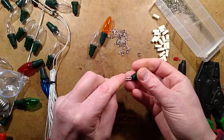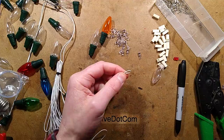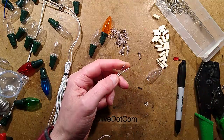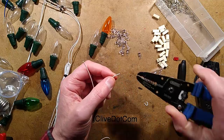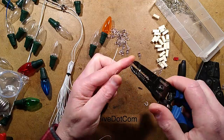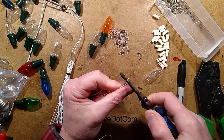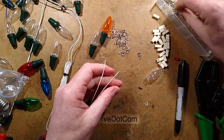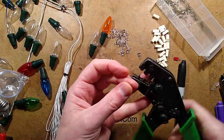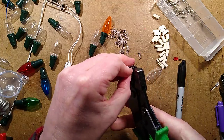Now I've pushed the wires through, I'm going to crop it flush and strip it with a Draper stripper - only about three millimeters at the end, since it's going into crimps. Here's the crimping tool. I shall load a crimp into the crimper and crimp this in. You can use a basic cheap crimper if you wish. This is the crimper I got from Rapid Electronics a while ago because it works with these connectors extremely well - it's designed for these connectors, not a universal one.